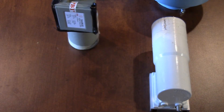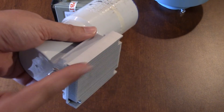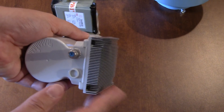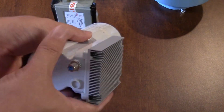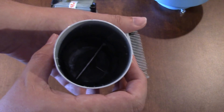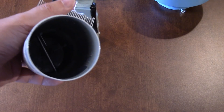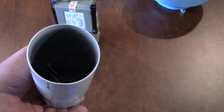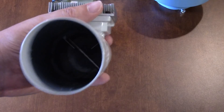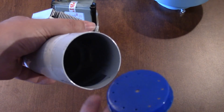I've cut my hand on this heat sink many a time because I had to reach in. It's not razor sharp but when you're trying to adjust the skew in a very tight place, this heat sink is a pain. I have reference points on there for my Titanium C1. On the inside of the LMB you can basically see just the antenna inside there. I don't have the little plate in there because in North America there's not a whole lot of circular C-band channels, so I just left it out.